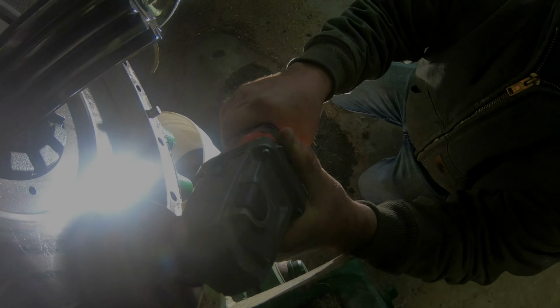The old brake disc is kind of glazed over, and these cutout areas are starting to flake off. Now, there's still a good bit of material there, and I'm thinking the other disc is going to be worse, just by what I found in the filter screen, or in the sump screen. So, gonna put the new disc up in there a while.